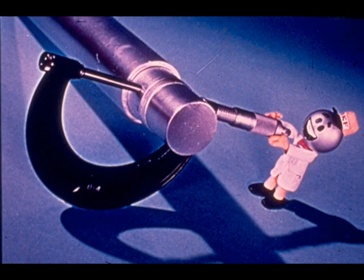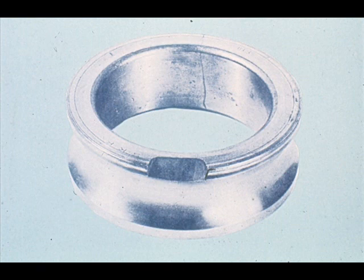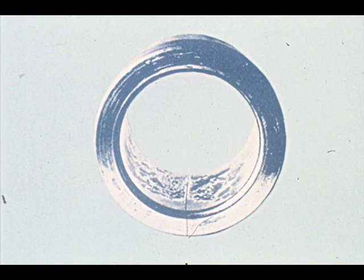The improper installation of bearings is often a major category of bearing failure. The fits must be measured very closely with special attention to the specifications set forth by the bearing manufacturer. A bearing can be damaged very badly if its fit on the shaft is too tight. A bearing must have an interference fit on the shaft, but only within limits. Here is what happened when this bearing was mounted on a shaft with an excessive interference fit — you can see the axial crack that ruined the bearing. Here is another inner race that has been cracked, caused by fretting due to yield in the shaft journal.